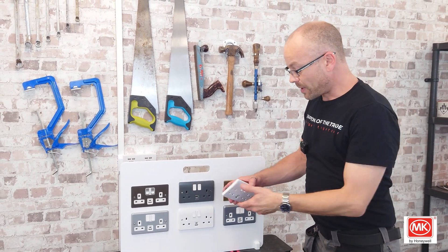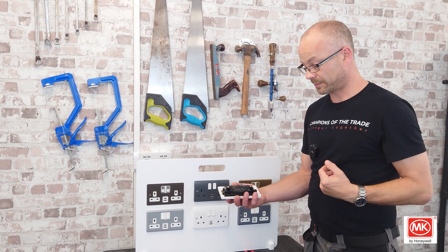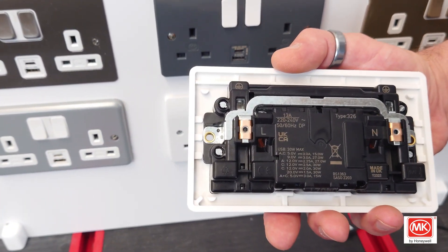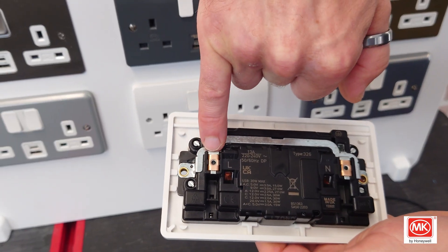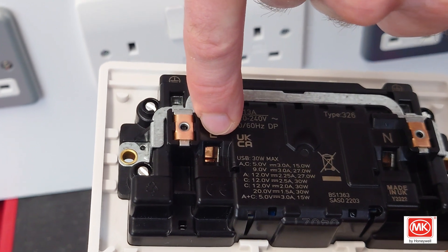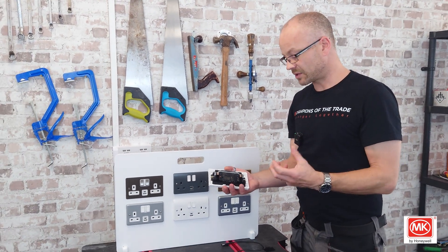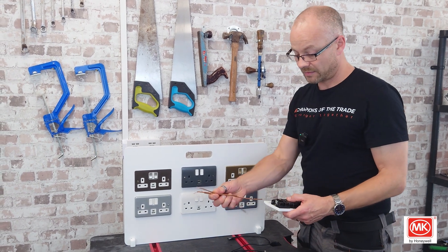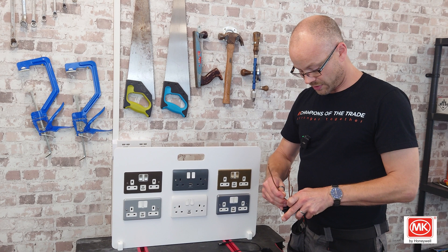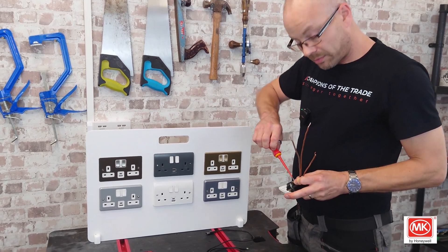And they will also fit a 25 millimeter back box, so you don't have to worry about pulling the old one out and putting a new one in. They've got the ratings written on the back for all the USB outputs, so you know exactly what you're going to get. On top of that, they've put copper over the metal connections inside the terminals, increasing the connectivity value of the cabling going in and reducing the resistance. And if I take three pieces of 2.5 millimeter twin-and-earth, they go in with ease — absolutely no problem whatsoever. So having that ring circuit, and if you needed to add a spur, you wouldn't have a problem with that whatsoever.